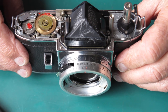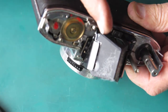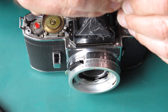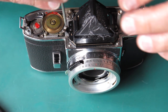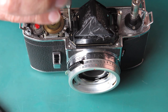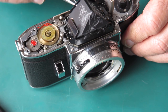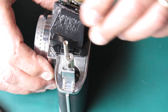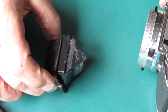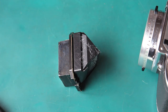Next I want the prism off. You can see there are a lot of whiskers on that prism — I've never known exactly what that is. I believe it's something to do with the coating or paint that covers these prisms. Whether it's some sort of crystalline product I don't know, but hopefully it's not blue asbestos — though who would know. I'll lift that prism off and carefully wrap it in a tissue and put it to one side, as all these components are very delicate and easily damaged.